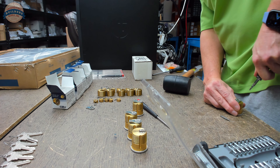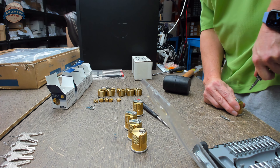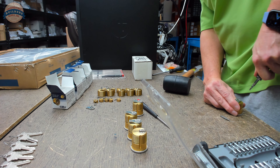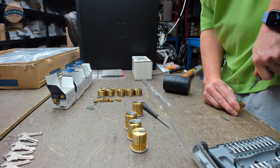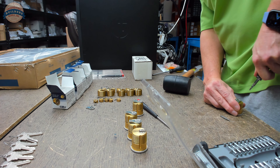Whoever invented the VMAX idea basically made life a lot easier for distributors, because distributors didn't care so much whether the door was beveled or square edge. Even though a bevel door is superior in every regard — that three-degree bevel, one-eighth for every two inches, gives you a nice relief to the edge of the door on the lock side — old-timers will tell you you don't need a bevel on the hinge side. The lock side is where you need it. The D-door was beveled on both stiles; the VMAX was square edge.